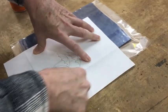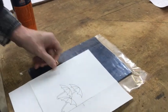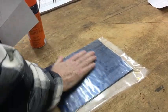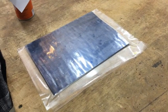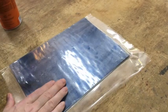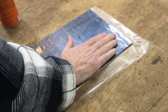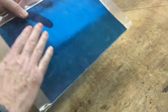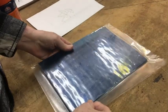Now I've got a pretty good line here, so when I come back to put it down, I'll have it. Now this is the resist. A lot of times on a piece like this, we would put a thicker resist, but I think we'll be okay with just this one single piece of contact paper. Jeannie has laid it down so that it's on the front and also on the back. The back's not as important, but you can accidentally get overspray when you're sandblasting, so I want to be careful of that.